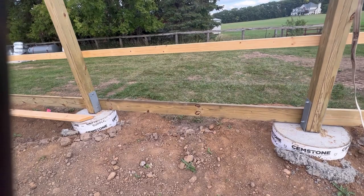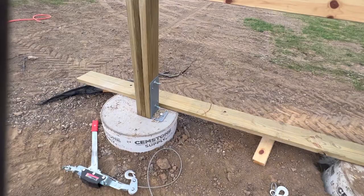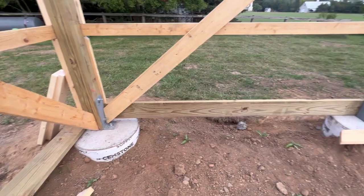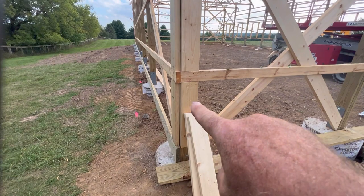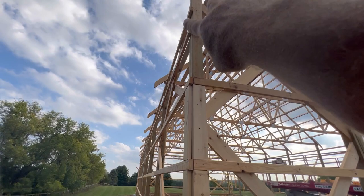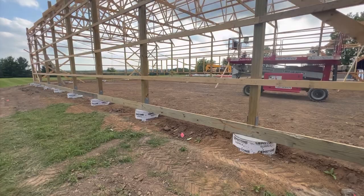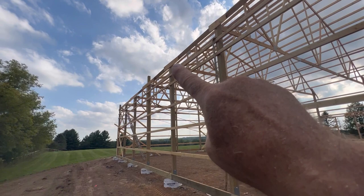It's about 12 inches of foam just to keep the heat from going out through the slab. We've also got all of our bolts top and bottom, and all of these are anchored in. All our posts are done now except for one which we haven't got the last two bolts in yet. We went ahead and stacked in some two-by-sixes here so we have something to screw our corners into all the way up and down.